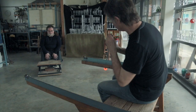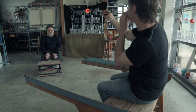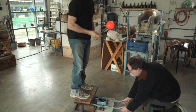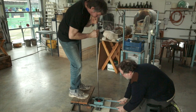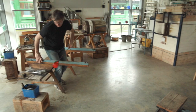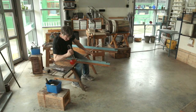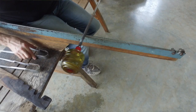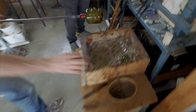After a few moments, allowing the glass to cool a little bit, I can then transport it over to the mould and dip it vertically into the open mould. I ask David to close the mould, then I will blow hard for a few seconds, and then I ask David to open the mould. I can then extract the glass which has now become — just turned into the shape of the beaker. I take it back to the chair and check that the base is flat. Then I remove it from the blowing iron by taking it over to the cracking off box. A little bit of water dropped onto the neck of the bubble will create a crack starter, and a sharp tap will crack the glass away from the blowing iron, which I then hand to David.